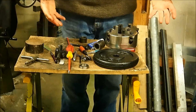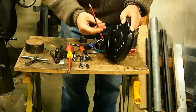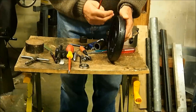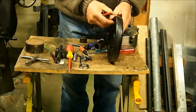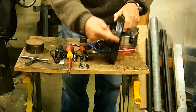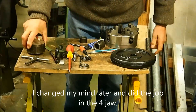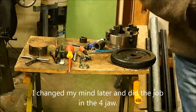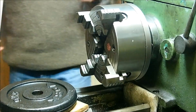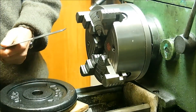So I won't bore you with the verbal details — let's get on and start the machining. First thing I'm going to do is put this in the four-jaw, bore that out to a mandrel size, put this on a mandrel and do most of the rough turning on that. It's easier than swapping it backwards and forwards on the four-jaw, because if I put it in the four-jaw I won't be able to do the outside surface. I wouldn't normally show you me struggling to get this in the four-jaw, but there seems to be a bit of interest in four-jaw work recently, and apparently there was a competition — and another one coming up.